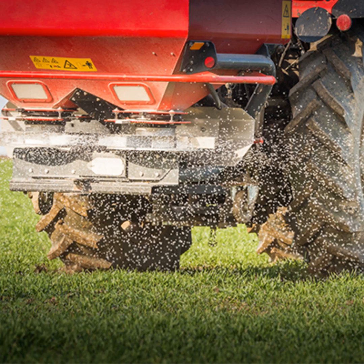A lot of people start on the inside. The first thing I'd be looking at is actually the agitator down at the bottom of the spreader itself — that's one thing that's probably completely neglected. It will wear out over time. It's vitally important because it gives a nice smooth flow of fertilizer, so you're always getting the same consistent flow of fertilizer out of the machine.